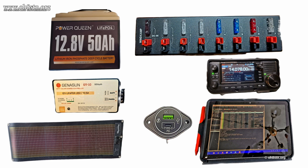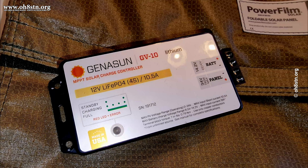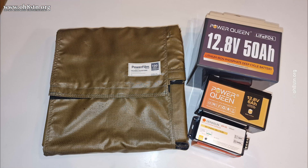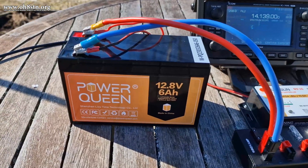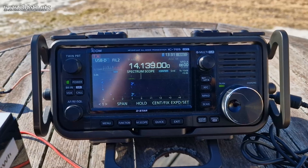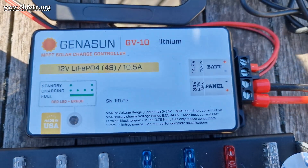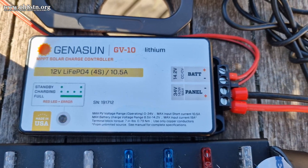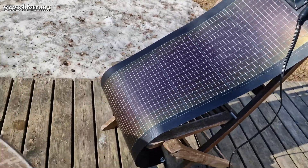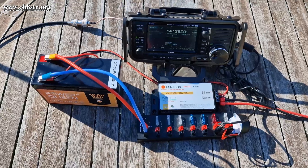The basic components of such a system include a battery, which stores the power we get from the solar panel. It also includes a charge controller, which negotiates between the solar panel and the battery to ensure the battery is being charged adequately and accurately. The system also has a solar panel with two jobs: keeping the battery topped up while simultaneously replenishing it as we discharge it with our gear. Having the ability to replenish our battery while simultaneously discharging with our gear is a critical aspect of off-grid solar power systems, and it ensures our system doesn't turn into a boat anchor if the battery happens to be dead.